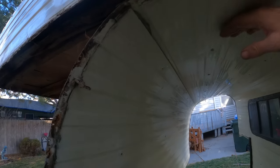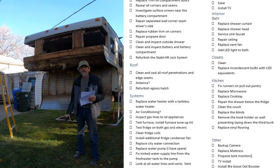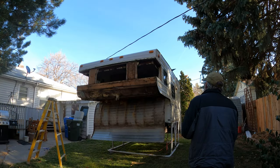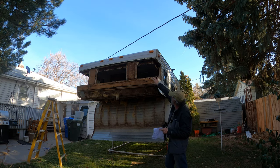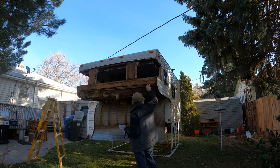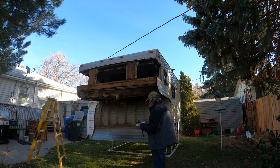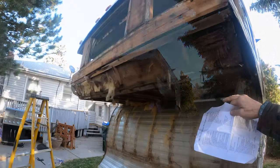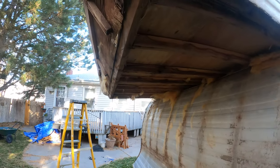I'm going to go ahead and pull this off. I've got a pretty good list here of things — about 50 items on the list. I'm going to have to completely rebuild this. There may be a little damage in here, but the wood seems fairly sound in some spots. This wood in here is pretty bad and will all need to be replaced. These 2x2s that hold up this deck are going to need to be replaced as well.